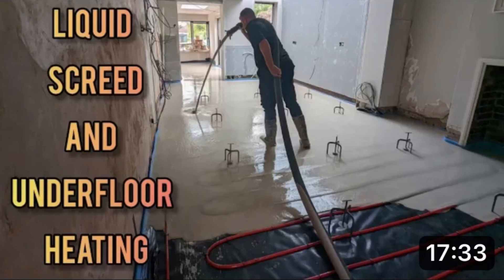After that, me and Michael stop and hand over to Martin, our underfloor heating guy. You may have seen him on the channel before when we did the other job in Harborne. From the comments, you all wanted to see him again. We're going to put you into a time-lapse now — it basically entails scraping, sweeping, sweeping, sweeping, then DPM in sheets taped on the joints and up the walls, then insulation. Right, let's get on with it.